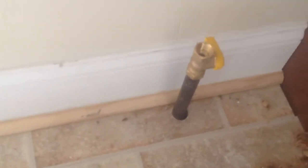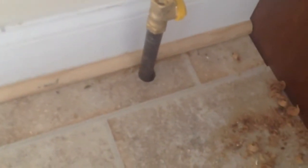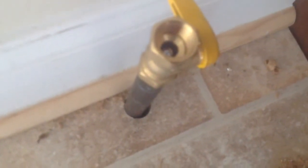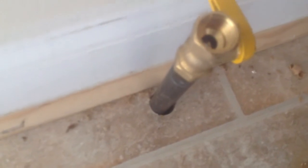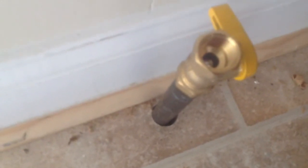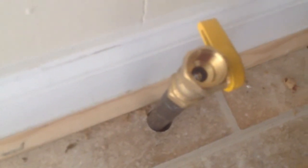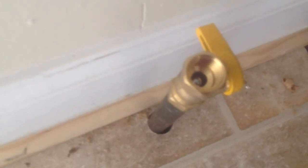Here is our range hookup, and you can see where we came up through the floor with the black iron pipe. I don't have a flange here — I like having the black iron pipe come right up and then connect to the oven with your flex line. I don't like using floor flanges because I can get that pipe right up against the wall, and I just trust that a lot more. So there I have it — a completed CSST system, installed the way I like to do it.